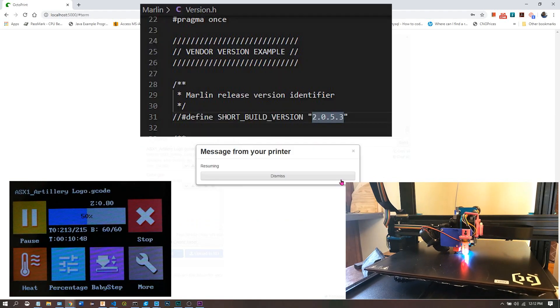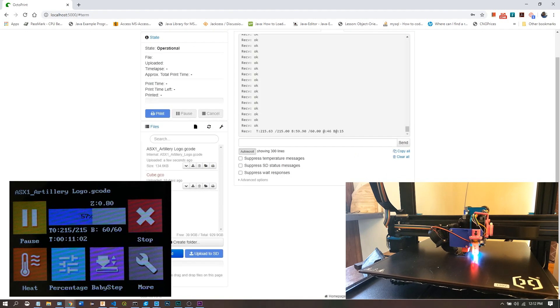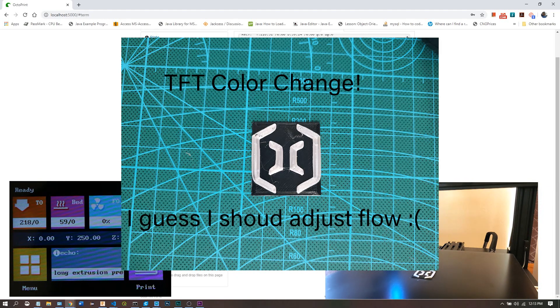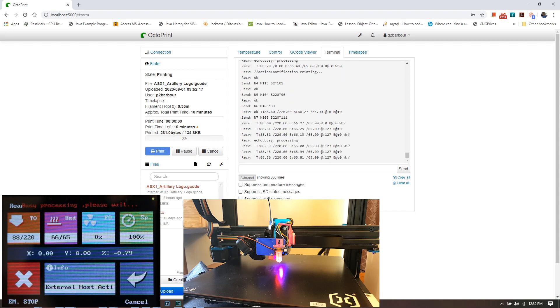I am running Marlin 2.0.5.3. There are a few things that are a little glitchy with Octoprint. For instance, if you don't reply to the dialogues in Octoprint telling you that the nozzle is parked or that you need to reheat before continuing the M600 procedure, Octoprint will assume you have not made it to the next stage and will not show you the purge more and continue dialogue. Keep in mind that what you're watching here is actually the first successful print using this method, so I'm learning a lot as I make this video and there are going to be a lot of improvements over the next few weeks.